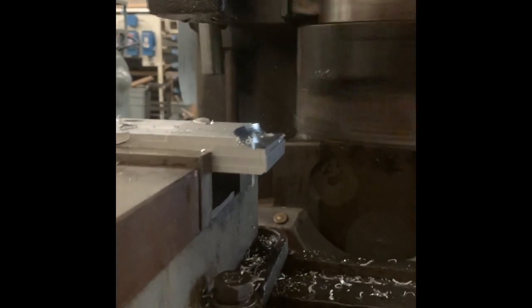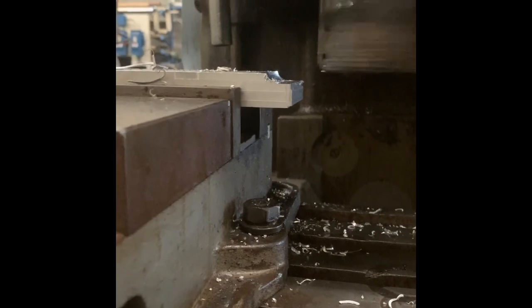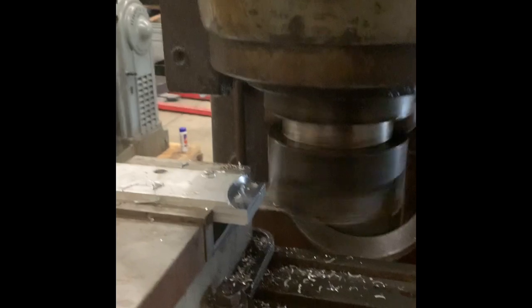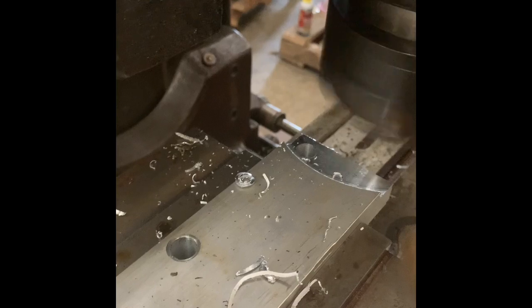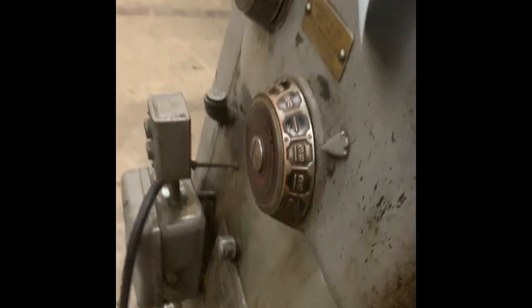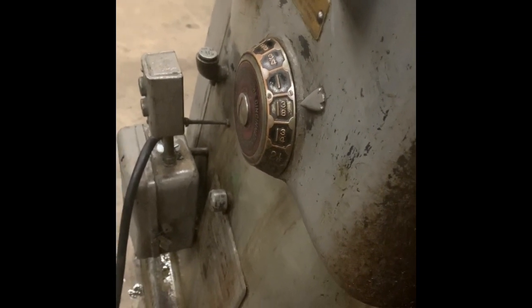This is going to be a coarse cut on this piece of aluminum. We've got it on 220 RPM, which is normally considered fast for a big cutter. That's about a 4-inch diameter carbide cutter with a bunch of little carbide inserts for the teeth. But aluminum likes to be cut at high RPM, and you can look up exactly what it's supposed to be. The feed we have is 1 and 3/8 inches per minute. We can change that — I'll just show you how the dial system works.